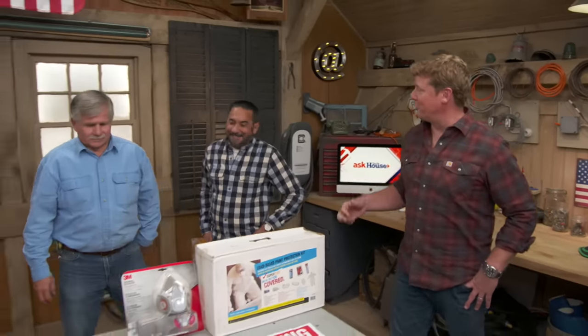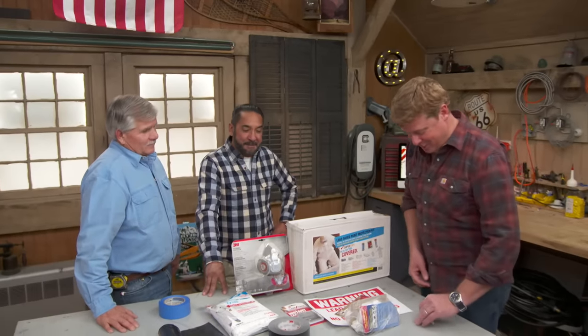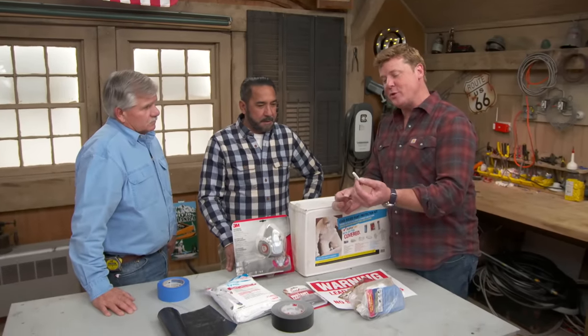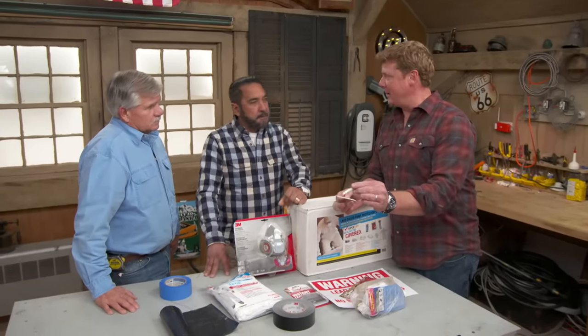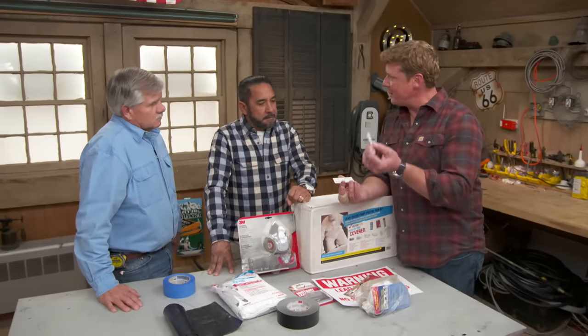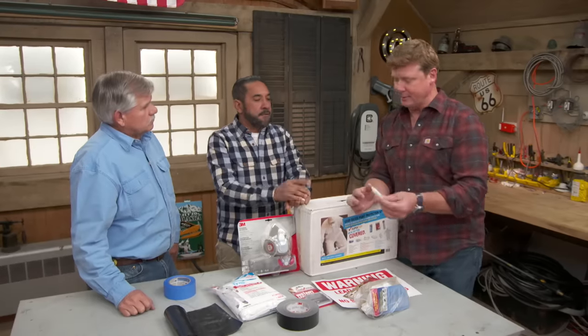It's a nice transformation for an old railing. That came out nice. And you got lucky that there was no lead — that's always a good sign. Just so you understand correctly, you did a secondary test. After you determined with your stick that there wasn't lead, you went back and used the card they gave you — sort of just to prove that the stick is actually capable of finding lead. You want to make sure you don't get a false negative. By showing pinkish or red on the card, it shows that the test was good, because we know that card has little traces of lead in it.